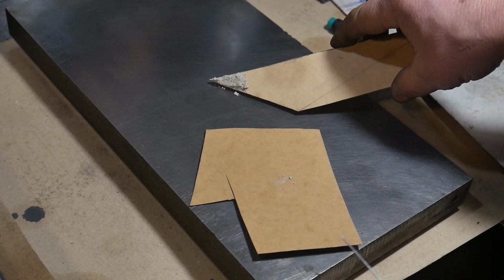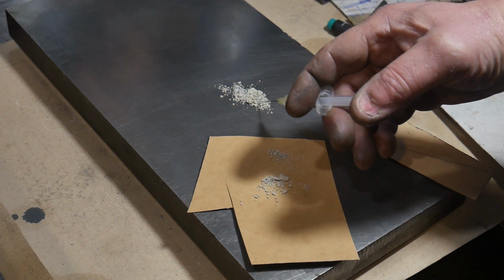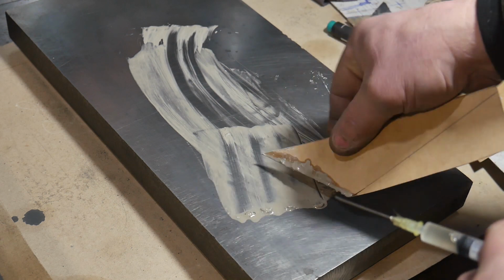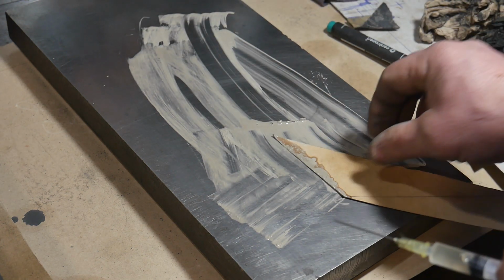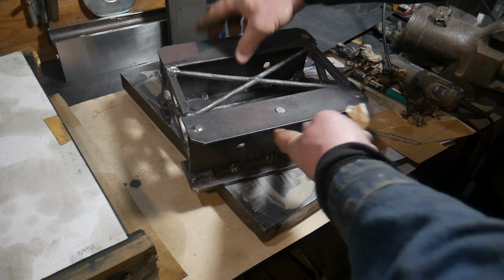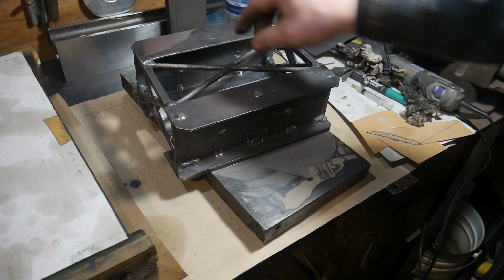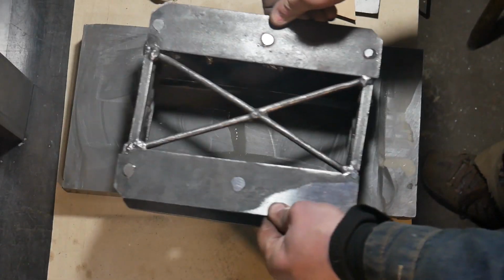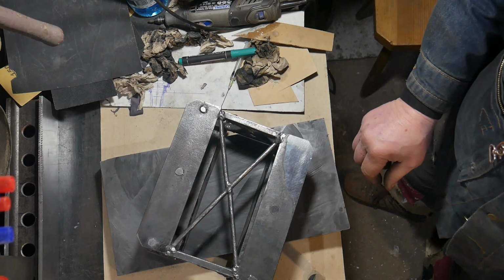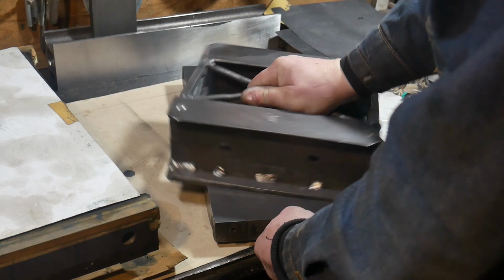I will lap the spotting tool next. Fairly fine abrasive and oil. Flat slab for lapping from structural steel. Lapping for a long time and slowly, in order to produce less heat.